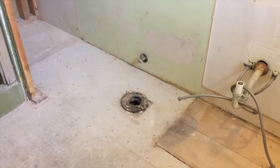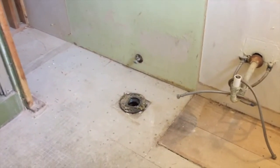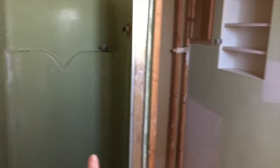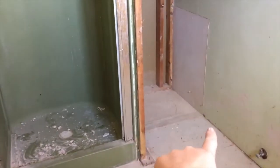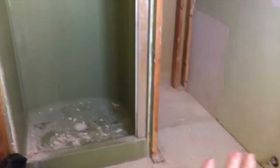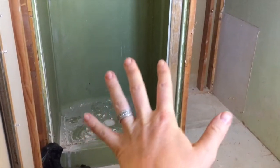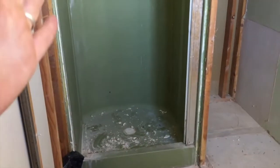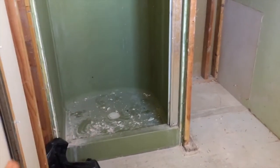We're trying not to move very many plumbing or electrical things. This space will still be our vanity — I'm going to measure that and figure out what size we need. We'll replace the lights up there with nicer ones. There's going to be lots of drywall patching and fixing. We're leaving the toilet right there so we don't have to move the drains. We went under the house and those two drains would have been a really big pain to move. The shower is easy access right under the house — we're just going to move the plumbing from this wall into that wall so we can have the entire shower there. I'm going to measure that and price out whether we want to put a prefab base in and tile the walls, or have a tile guy build a custom base so we can tile the whole thing.